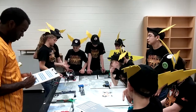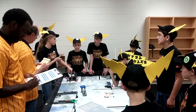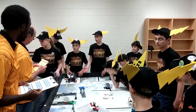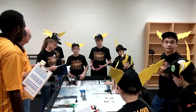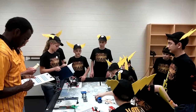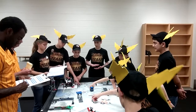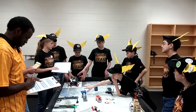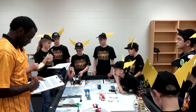And so we fixed that by using the gyro. We have several My Blocks that we made for the gyroscope. We have the check gyro, which checks to see if it's drifting because the gyro isn't the best product ever, and so it will drift. The check gyro resets the gyroscope to 0. Then it scans, then it waits, and it scans to see if it's moving. And if it is, then it ends the program, because we always put it at the beginning of our programs where it's sitting still in base. If it's not moving, then it just goes on with the rest of the program.